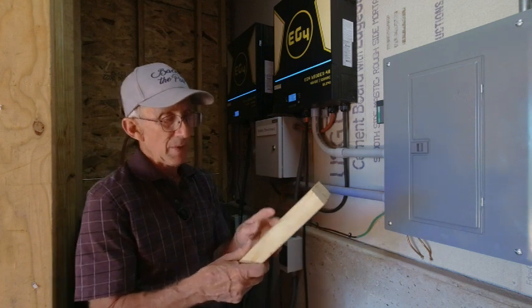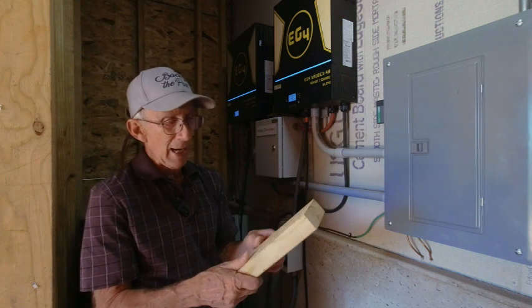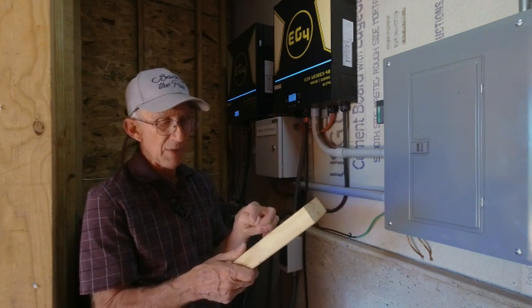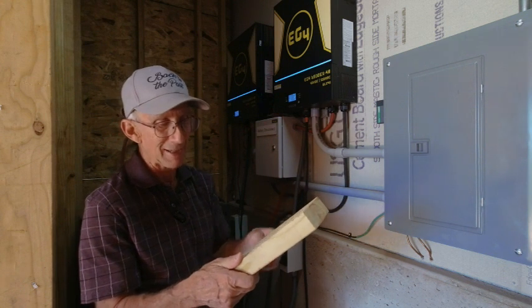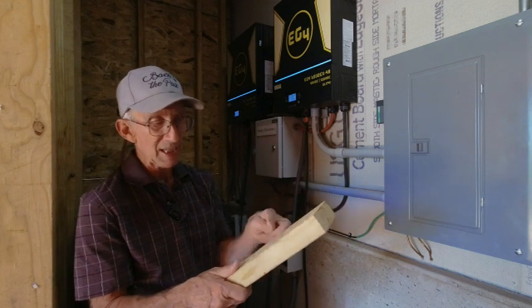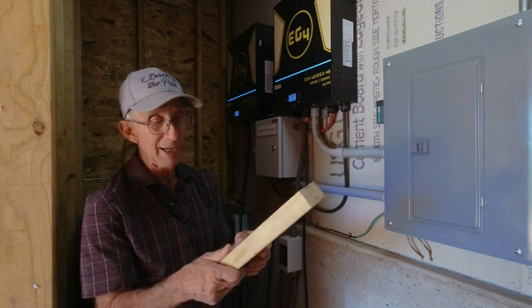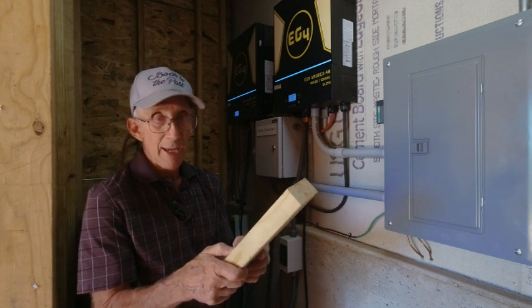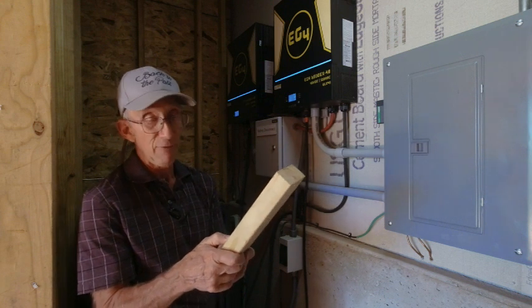On April 10th at 65 degrees, it was a little bit hazy. I had 239 volts and a total wattage of 4,490 watts — though I have to kind of throw that one out because we didn't have full sunshine. On the 11th, also 65 degrees but sunny, my voltage dropped to 223 volts and my wattage output was 5,950 watts.